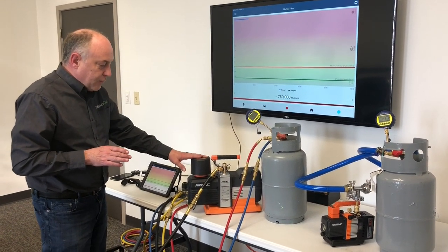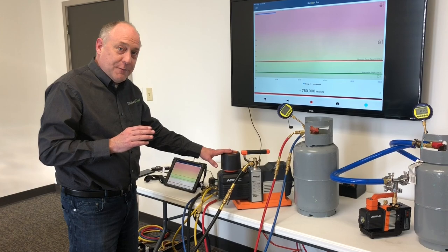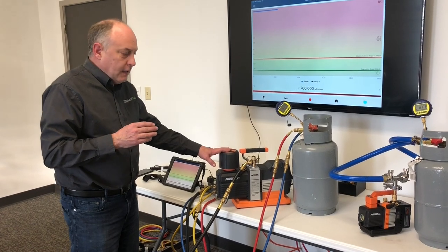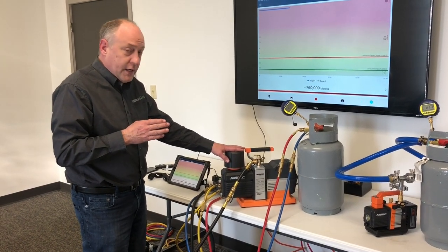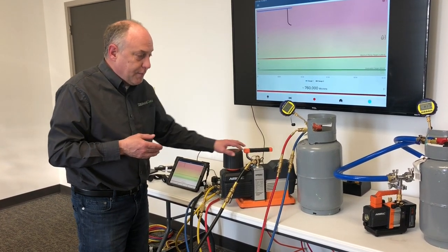This thing is pretty cool. It's a half-horsepower motor, rated at five microns, but it only draws about five amps of power. So you can run a 200-foot extension cord on this pump and it's going to start up every time. This is their Pro-Grade series of pumps — a really good pump. I haven't seen anything that performs quite as low as this; I've had this down to about two microns on the True Blue hoses, or actually two microns just on the pump itself.